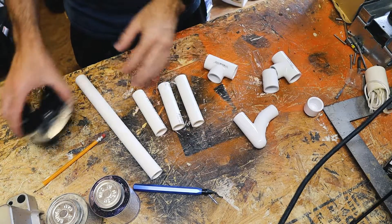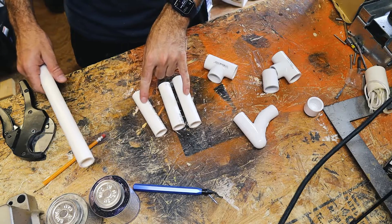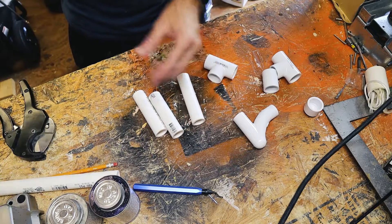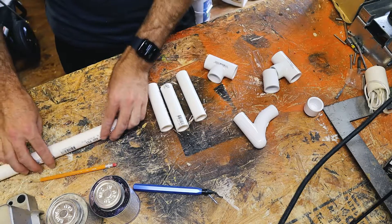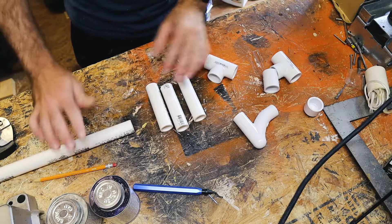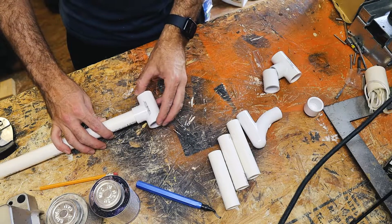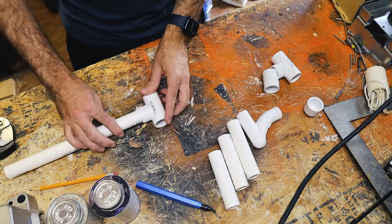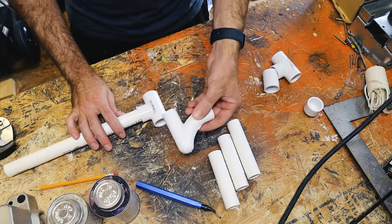Let me go ahead and assemble this. I cut my two-foot pipe into three smaller pieces, about four to four-and-a-half inches each — pretty arbitrary. Here's the diagram: this is the pipe coming out of the HVAC, and then I'm going to attach it to a T — just like that. I'm showing this from your point of view. Then I'm going to add the P-trap, which comes in many different shapes and sizes.